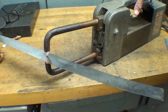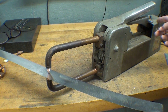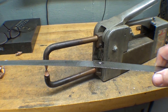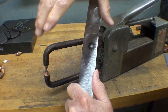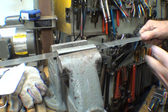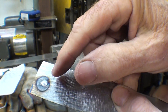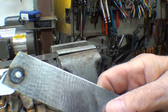The machine is on and I'm going to push the handle down and hold it down until the time cycle is complete — remember the timing on this machine is set here. Sometimes I would test a weld just to see how well the welder is working. What I'm trying to do here is twist it. I'm going to put it on the vise to finish that. Sometimes when you tear these apart you'll find that it pulls the metal all the way through one piece, leaving a hollow spot — and that just shows that you've got a very strong weld.